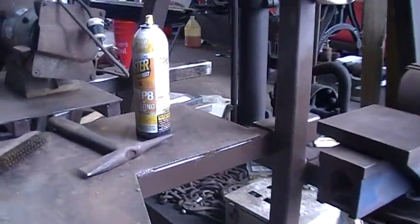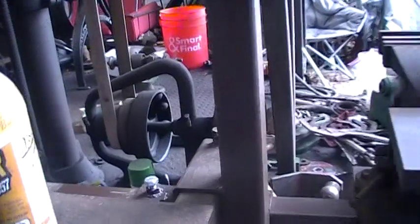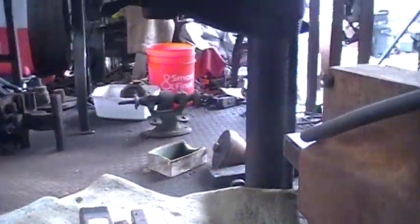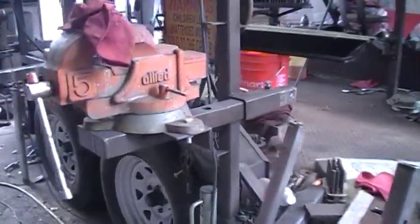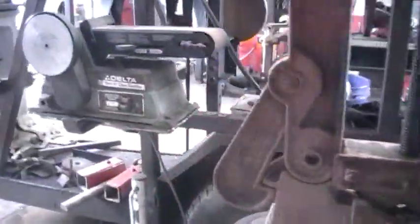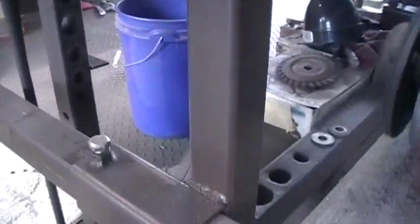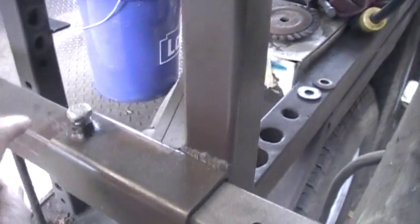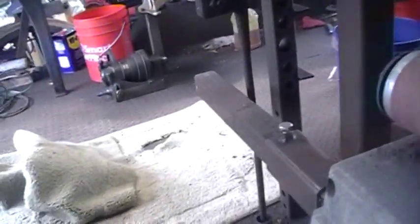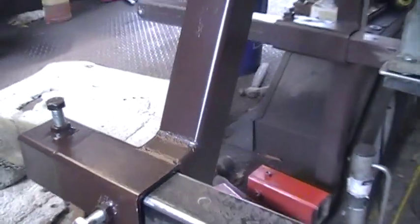All of these pieces that I put on here come off of a receiver — you can see one right there and one right here. I got this idea when I was changing over one old lathe to another and needed to get it off the ground to work on it. I put a couple of receivers in, and I found out it works better if you have one in the XY axis, which really stabilizes it a lot.